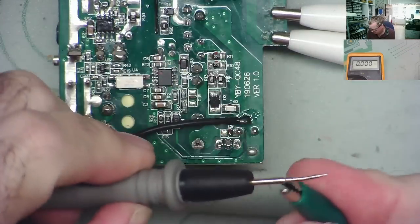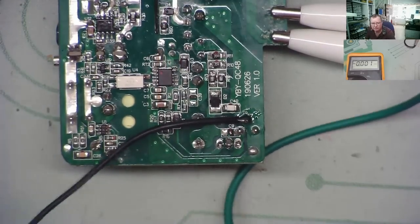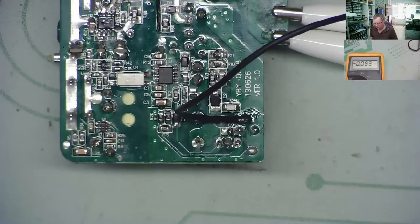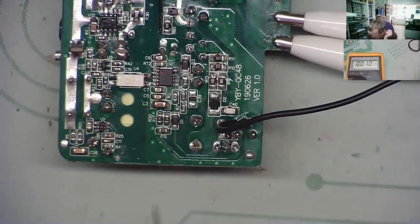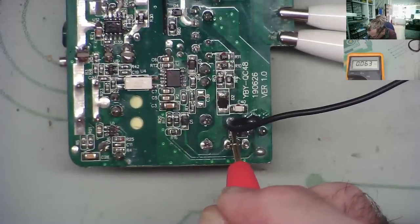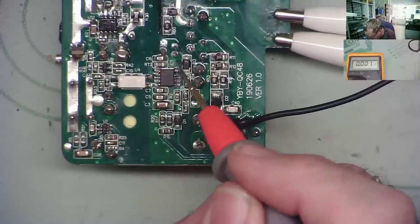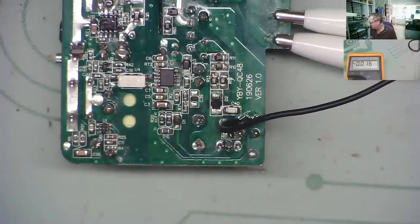Okay, I have a crocodile clip lead, so negative. This goes to the black meter lead onto this black wire I've just soldered on. So that's out of my way, where I'm not going to come into contact with it. Okay, and there we go, we can now power this up. Just before we do, this point would be the high voltage coming in, about 320 volts DC, I would imagine. The one that gives you a zap if you don't realize it's still charged 40 minutes after you switch these off. And this will be the pin 9. Okay, let's try it.